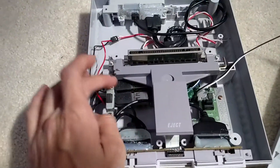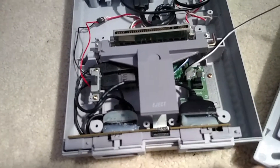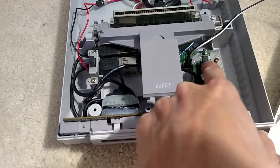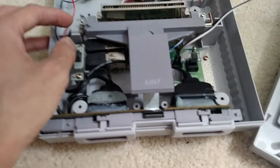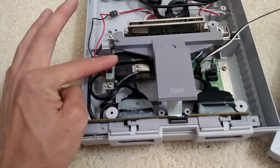This is a Raspberry Pi board inside. I'm not going to take all this apart. This is the reset board that I cut apart. I couldn't get it to work because I soldered everything up and realized the reset is a pull-up or pull-down, and it is the opposite of what I needed on the reset circuit board. So this is the power, and it does work.